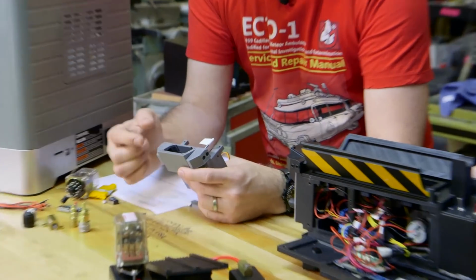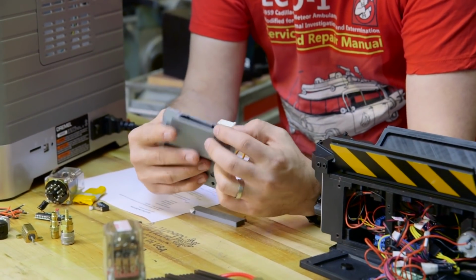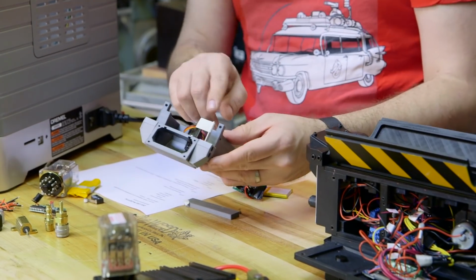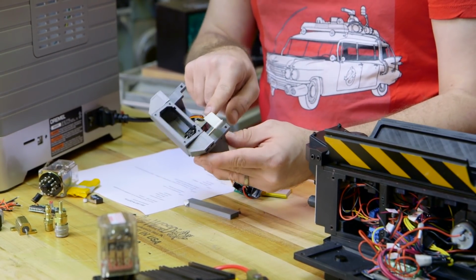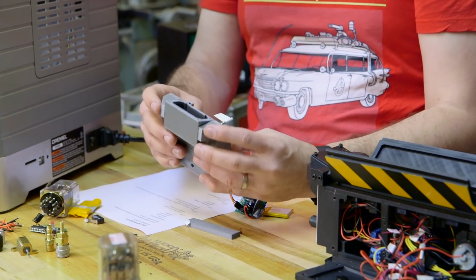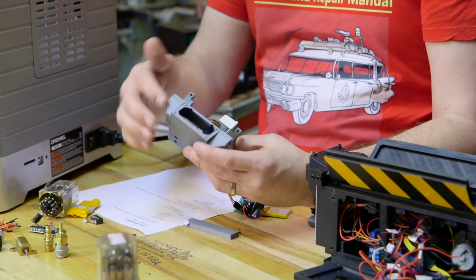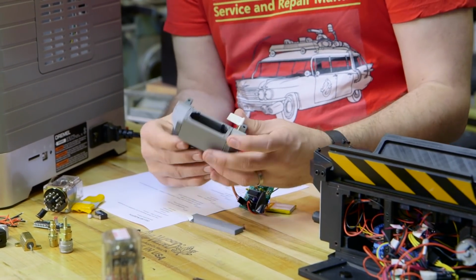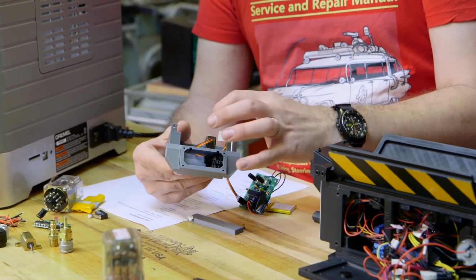slide on the side. There's axles that go here with little tiny sprockets on them, and there's sprockets here. Now originally, I had this micro servo that had one chain going from this to the wing. And it was too steep of an angle and it was rubbing on the housing and I couldn't make it work. So then I had to end up putting this transfer shaft in and running 2 chains.